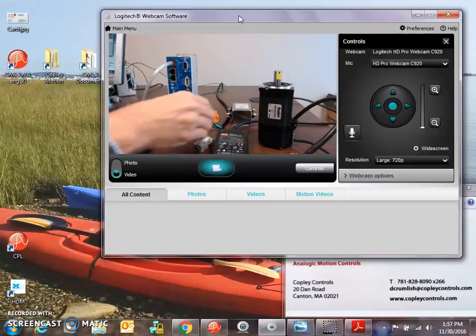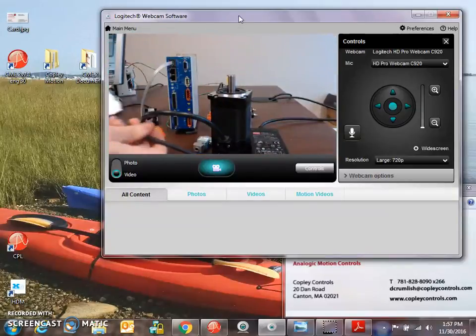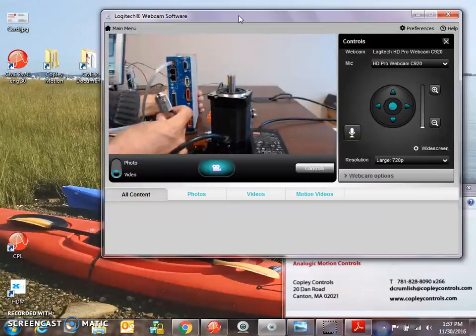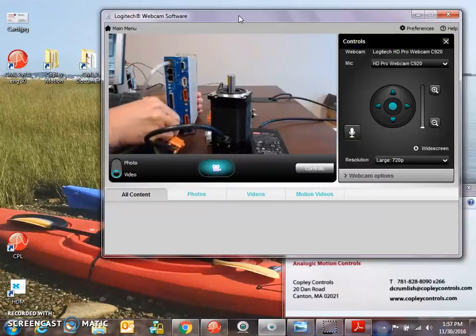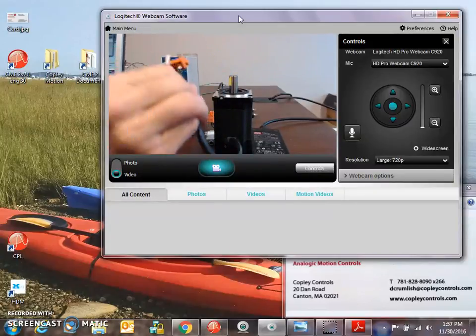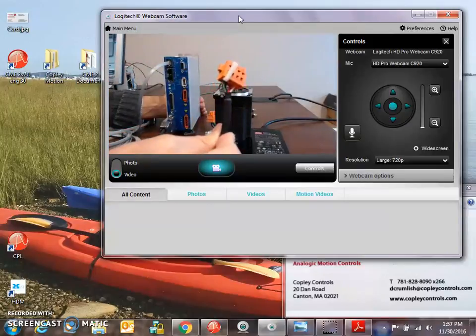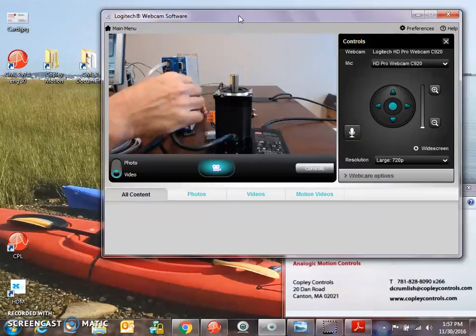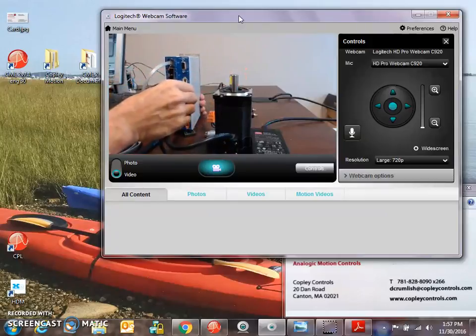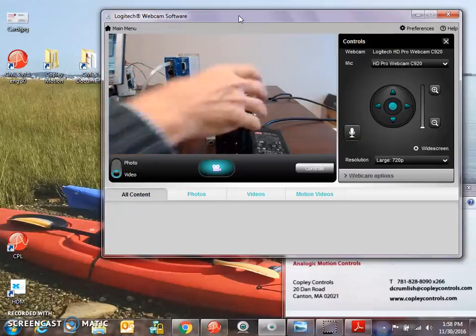Before I connect the power, I'm going to connect the feedback. You do not do hot swapping, so do not connect the feedback while the drive's powered up. Again, there's a little tool for the motor power, and you can see the green wire is the earth for the motor, so the case of the motor finds a path to earth. It's idiot-proof. You can't plug it in backwards.